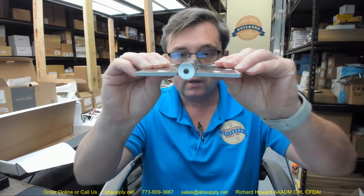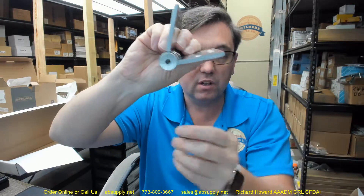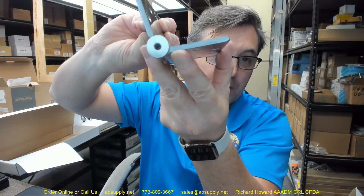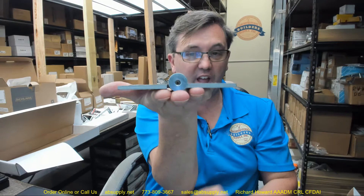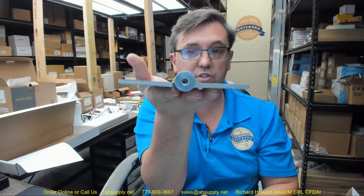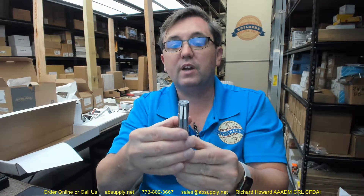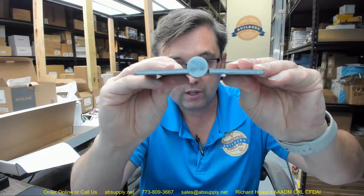Re-swagging the hinge is really the term you'll hear from people in the know. The swag on a hinge leaf is literally the relationship between the leaf and how it bends in right at the barrel — that's the swag. If it was a full surface hinge where you laid it flat down onto the surface, there would be no swag. When they put a swag onto both leaves and you bring the leaves parallel, that's how you're going to have a full mortise hinge. You'll maintain that margin between the two, and the only way to make that happen is to have a swag on the hinge leaves. That's what you're doing — you're re-swagging the hinge leaves.